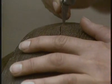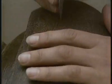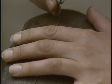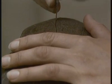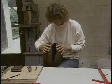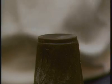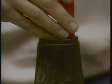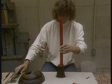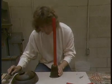For the investment mold to fill the core, the sculpture is separated again. A curved cut assures an accurate fit when the bronze is welded. Now gates and vents must be attached to the waxes. These wax rods will be burned out along with the sculptural wax, leaving channels for the bronze to flow through. The wax cup will become a pouring gate for the bronze.